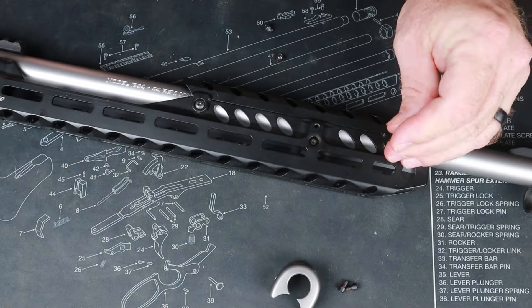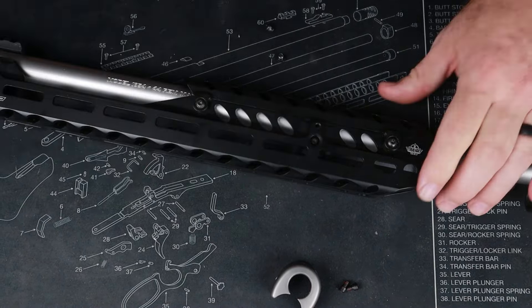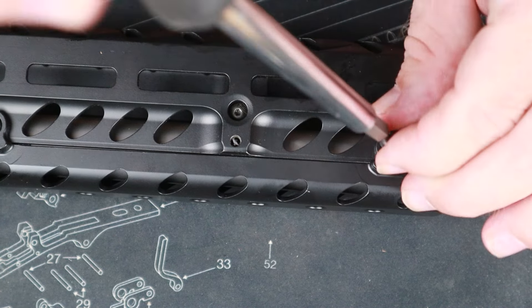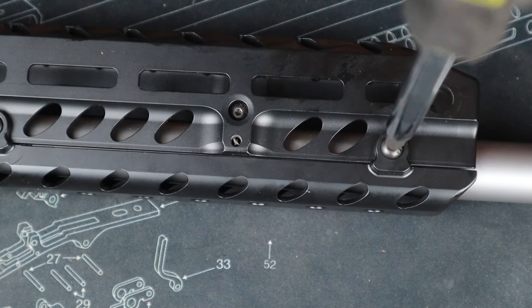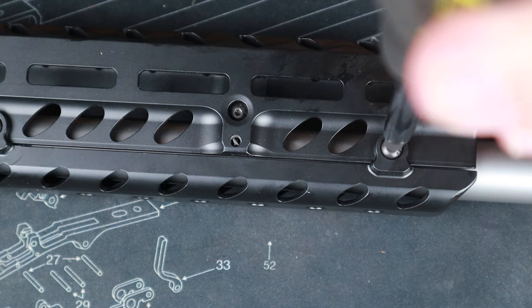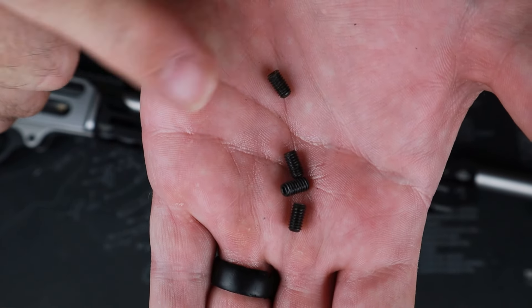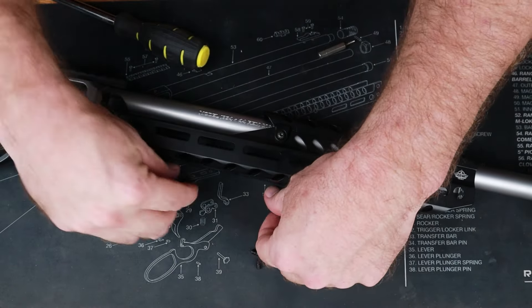This is intended to be a nice tight fit — our tolerances are really tight on this — so we need a little bit of wiggle room by leaving the fasteners loose. As you see, it just goes right in with no struggle; this is what we want. We don't want cross-threaded and boogered-up threads. Now it's time for our four set screws. These set screws are going to go in and simply touch off on the barrel — we've already previously Loctite'd these.